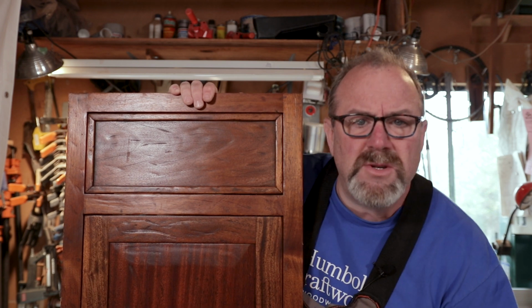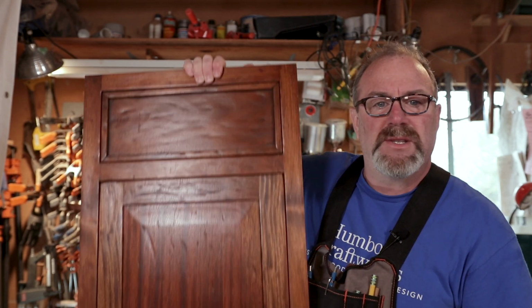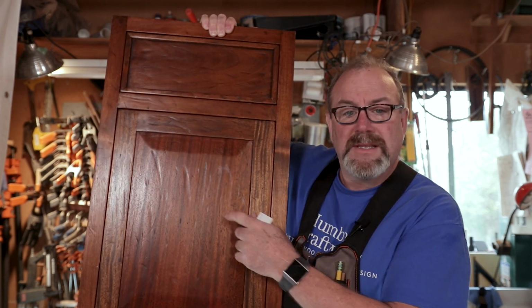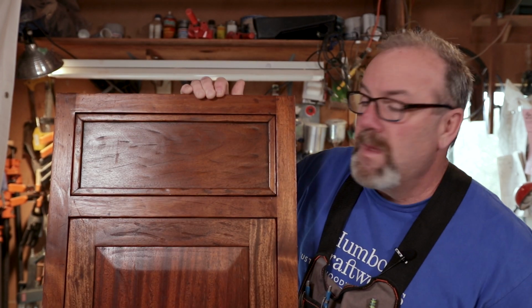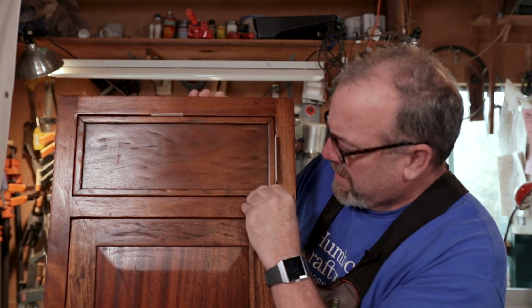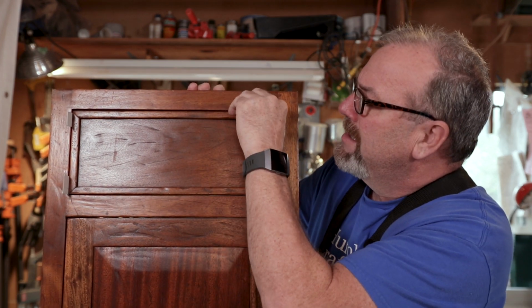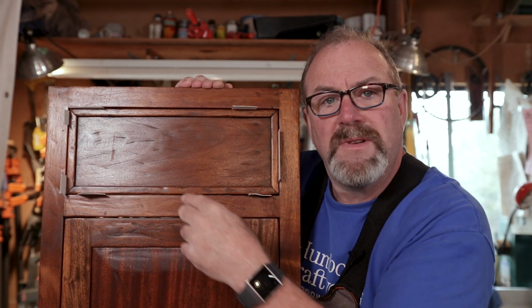I'm going to click this on, make sure I'm in focus. Am I in focus? What I did is he wanted really tight tolerances and really distressed wood. I mean, look at super distressed, craziness. And this isn't even as distressed as the one that he actually picked. So what I did is I used these little 16th-inch cardboard shims to fit the doors. I put them in the corners like this. You can put them up on the tops too, but I use these to give me a little space out, so I had a 16th-inch reveal around the whole thing.